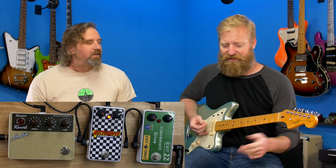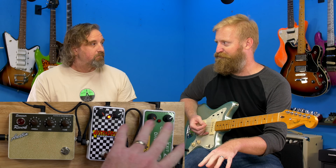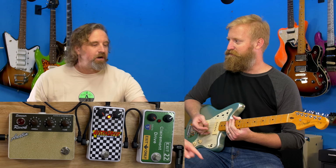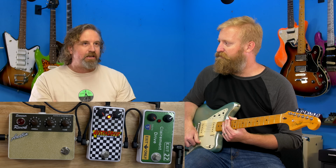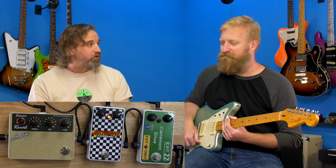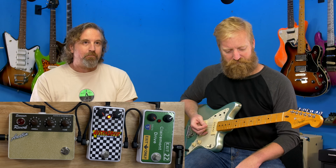That's a distortion. Like, this is an overdrive. The push is a little fuzzy. That's a distortion. So if you wanted to take off some of the high end, like I said, just pop in a capacitor and roll off that high end. It's guided in the instructions which ones to put in and where to put them.